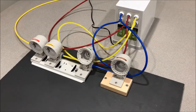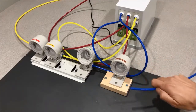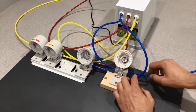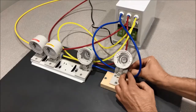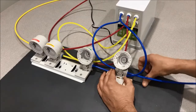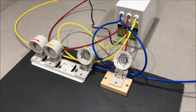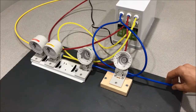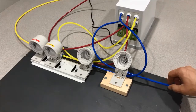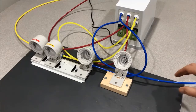The final connection will be the line that comes out of the other side of the DI cartridge. Install your tubing on there — remove the blue clip, install the tubing, then reinstall the blue clip. This tubing line is the line that will go to your collection container, or you could put it onto a float switch and run it right into a sump or a holding tank.